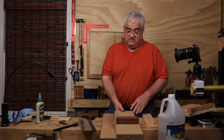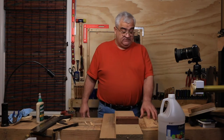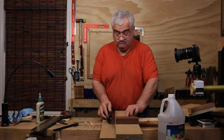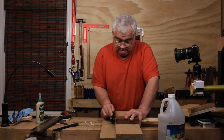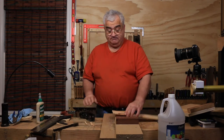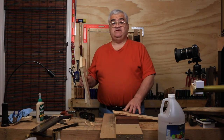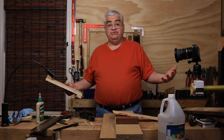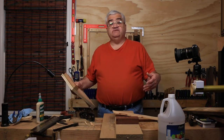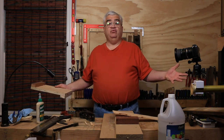The next jig we're going to build is the shooting board, which cleans an end up perfectly. This is a large shooting board — I'm going to build a much smaller one for this bench size. What it does is take the end we just cut, and you run a plane along it to square the edge up perfectly. That's the next video. The combination of the shooting board and the bench hook are the two jigs we need to make before I can do the all-inclusive tools-you-need-to-get-started-in-woodworking video, because the basic tool set needs these jigs to do some of their work. Thanks for watching — tune in next time for the shooting board, and then hopefully this weekend I'll post the 10 to 12 tools I think are essential.